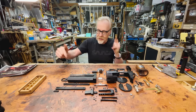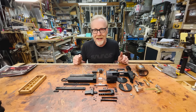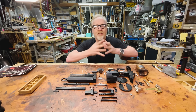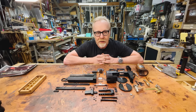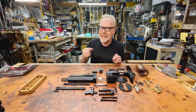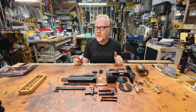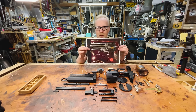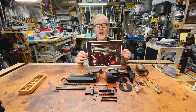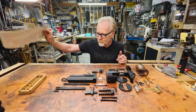What is different between now and the previous assembly video? The difference is that I had the aluminum parts of the gun chemically blackened. I debated anodizing them black, but the black coating of anodization — which is a coating of aluminum oxide — is super robust, way more robust than I actually wanted for my Samaritan. This is a departure from the original gun, which is painted. Here is the original gun built by Dominic Taylor at a workshop back in the early 2000s.